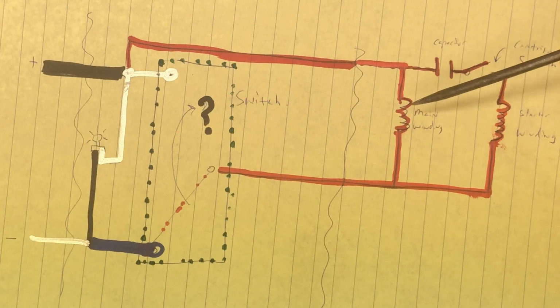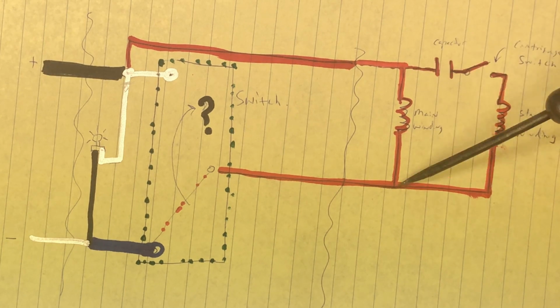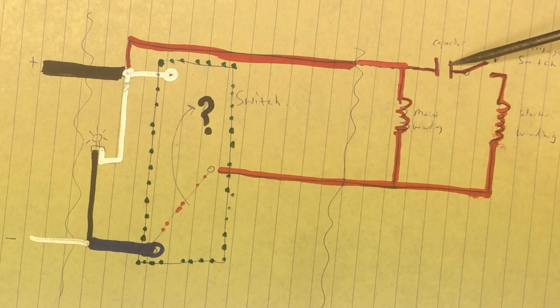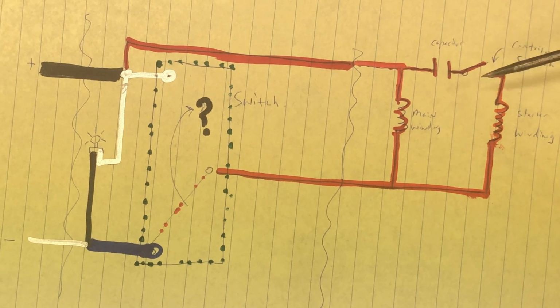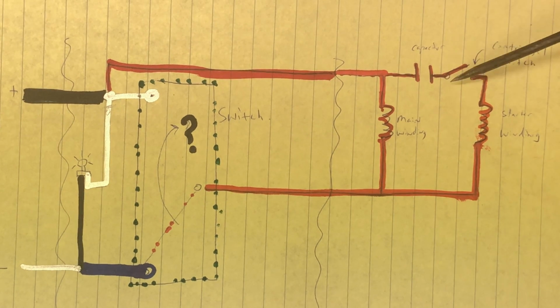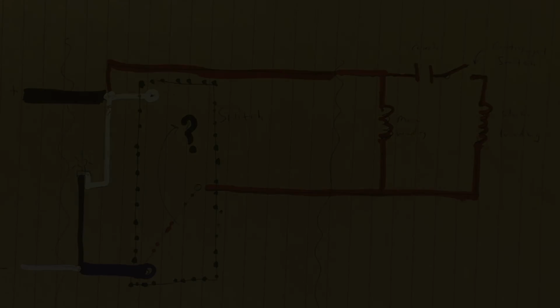If you're interested, I have a sort of understanding of how induction motors work. Basically, you have a main winding on the stator that drives the motor when it's spinning. And then you have a capacitor that is kicked in by a switch just for getting the motor up to speed. It's called a starting capacitor. That switch is what's called a centrifugal switch, where it starts connected, and then once the shaft speed gets to a certain speed, the centrifugal switch throws out and disconnects the capacitor. That capacitor drives another winding that's just for starting.